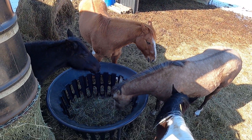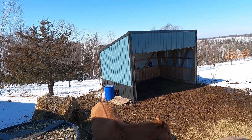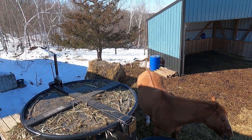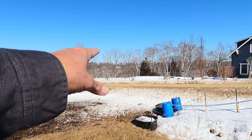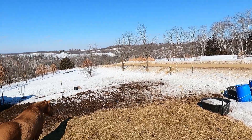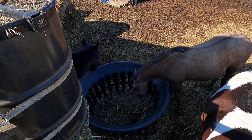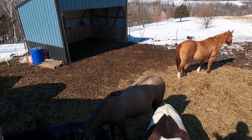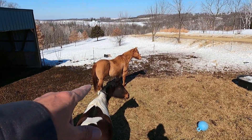Hello, naughty horses. If the fence is shorting somewhere you can usually hear it click from a good ways away, unless it's shorting in a whole bunch of places and it's really weak. If it's not shorting anywhere along the way and there's just a single short, sometimes you'll see a little spark — but it will definitely make a loud tick. These guys aren't going to care about it right now because they've got food, but as soon as it runs out they'll go test the fence.